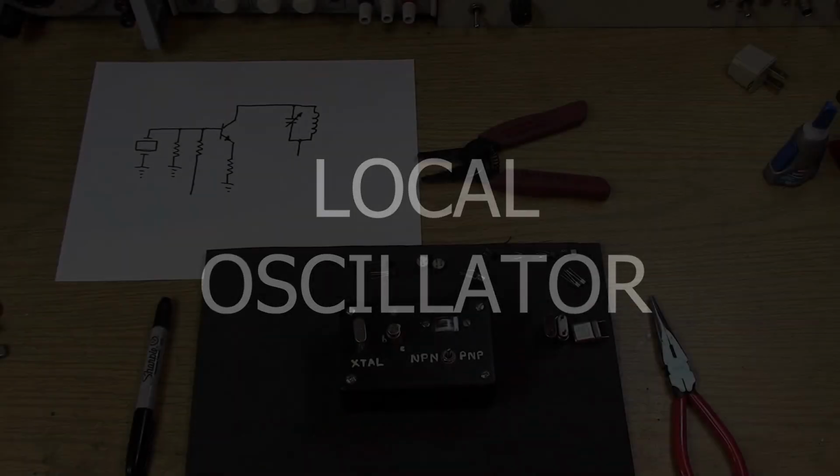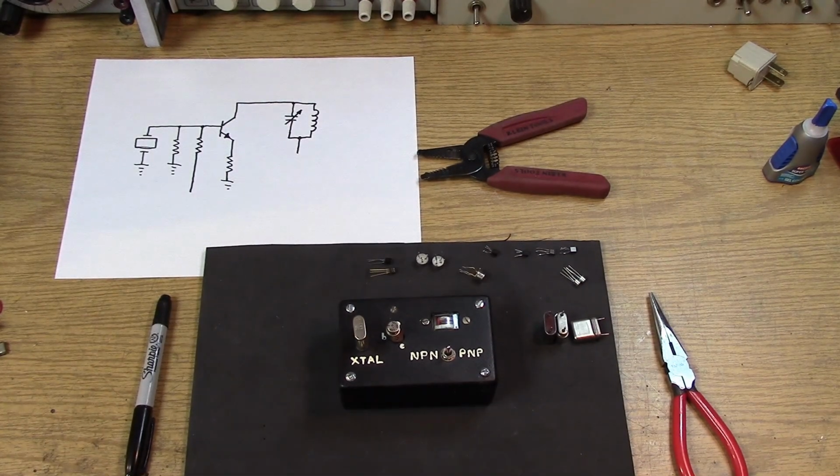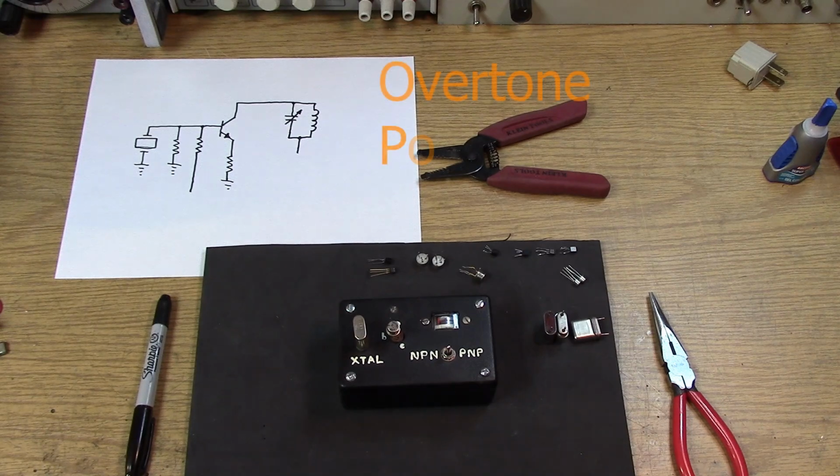This is a starting point where we begin to develop circuits one at a time, and the first circuit we're going to develop is the oscillator. For our shortwave up converter, we're going to need a crystal oscillator operating between 40 and 120 megahertz. And this calls for an oscillator style called an overtone oscillator. Typically, the crystal will be cut for 1/3 of the frequency that you want to operate on. Sometimes there are fifth overtone crystals that are used at the higher frequencies, so the fundamental cut of the crystal is 5 times lower than the actual output frequency that you're operating on.